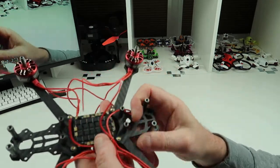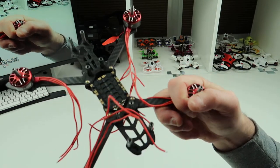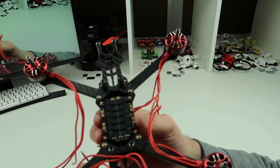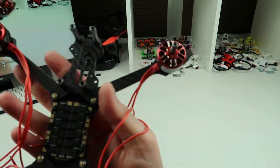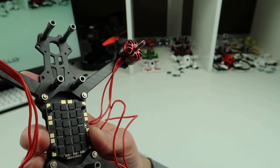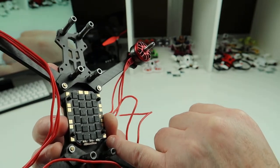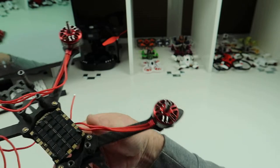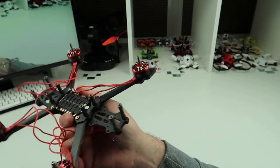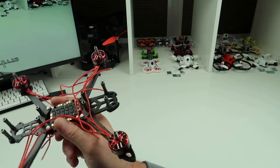As you can see, I've mounted this ESC. If you've never built before, it's an important thing — make sure you put this the right way around, because if you don't, these motors are going to be in the wrong position. Let me see if I can get this in focus. So this is my back, and I've got one, three, and then four, two. These are the right way around — that's going to be motor four. Make sure it's the right way around, or you're going to have a hell of a problem trying to sort it all out once you've built it.